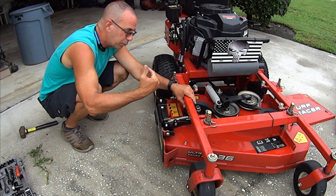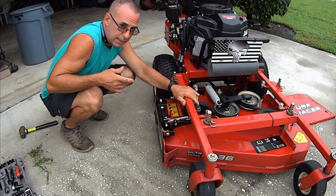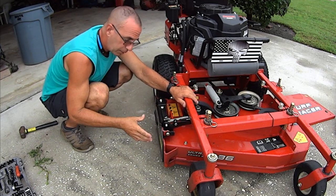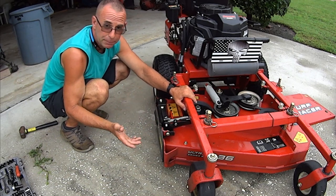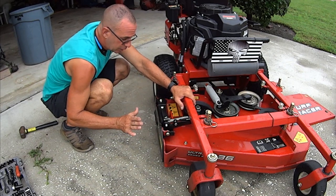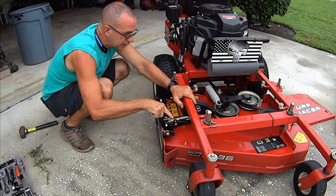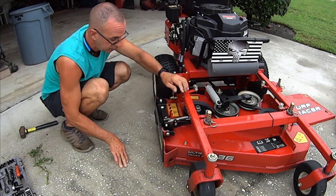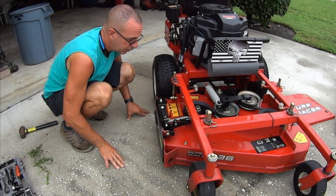When I'm cross-blading and creating that much wind with that much volume of clippings, it's my fault — I should stop and rake. There's a limit to everything and I'm beyond the limit of this unit in those conditions. So: properly install it according to the manual — the manual tells you exactly what I just told you — but people don't take it to that level. Adjust the mounting position and adjust your spring tight. I've got barely a half inch of spring left; it's holding very tight.